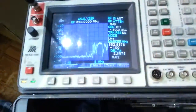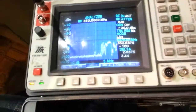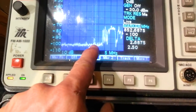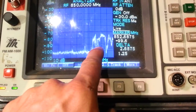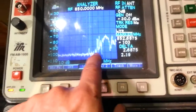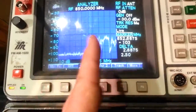This box right here is called a service monitor, and I have it in spectrum analyzer mode. The signal I want to receive is right in this area here. All this other stuff is 800 MHz cellular downlinks from the cell phone towers — all this mess is what cell phones are listening to. Your receiver, even though you don't hear that, sees all of it and has to contend with it.